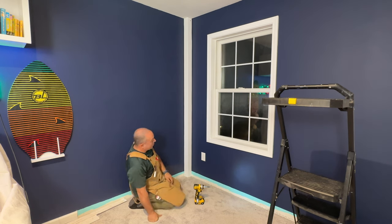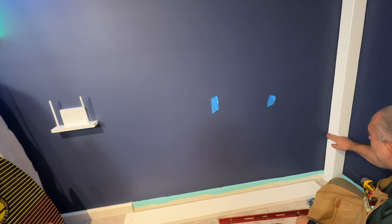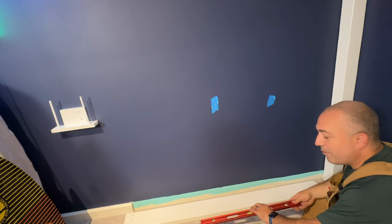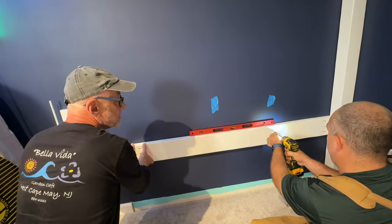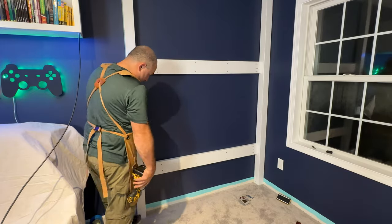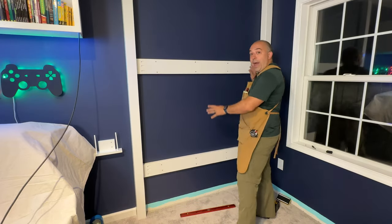DeWalt made quick use of that five-inch screw. I have a nicely painted wall and a painted bed frame, so I don't want to be putting pencil marks. I measured 16 and a half inches up and put a tape strip cut with scissors so it's very flat and level. We're going to pick this up, screw it in, and use a level to make sure we're level all the way across before we screw into the two studs I marked with painter's tape. That way I can pull the tape away and it won't leave any marks behind. There is no stud behind this beam, but I'll still drive a five-inch lag screw at the top and bottom, hitting the horizontal bottom and top plate in the wall construction. So we have the first wall done.